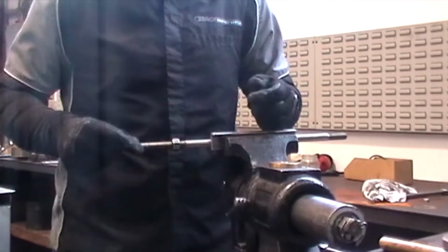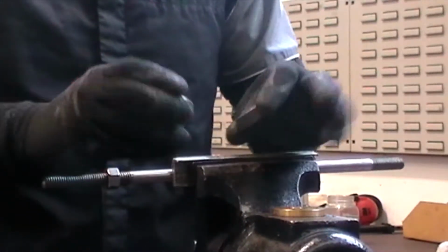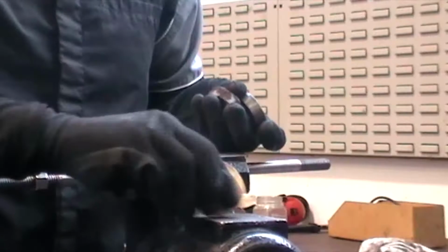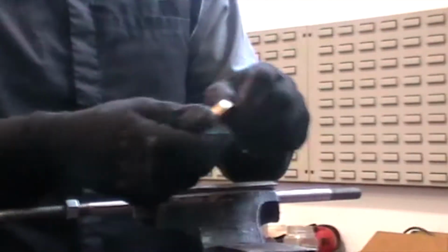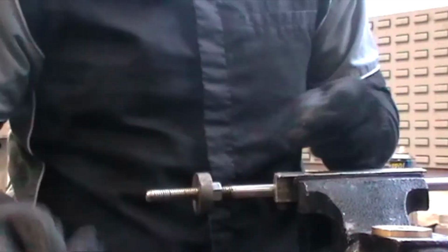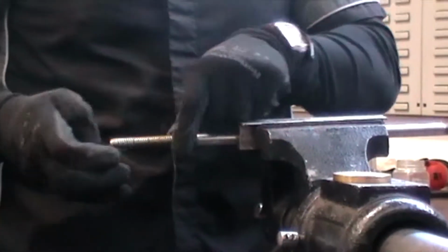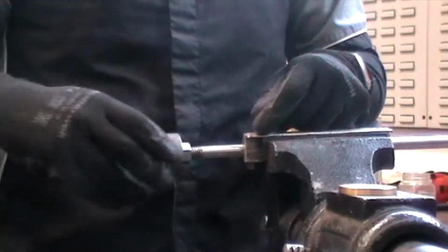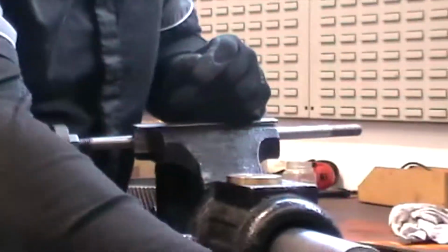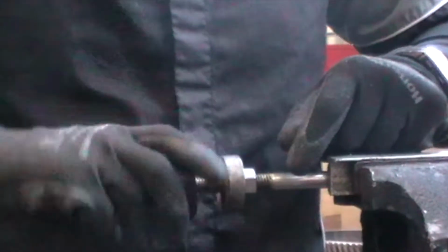Once I've taken the plunger assembly apart, always check the condition of all your parts. So these are the two plunger ends and the plunger center. Make sure they're in good condition. Okay, from there we're going to take the first plunger end, which goes up. If you don't need to replace this, keep it in condition because this will keep everything nicely worked out together. That comes into there. We're going to take the new cup, wind that on.